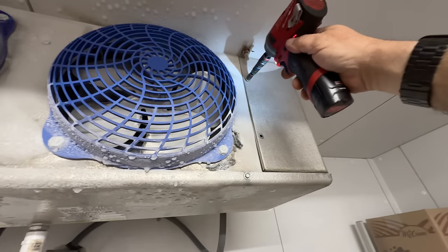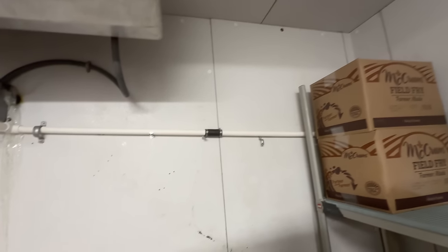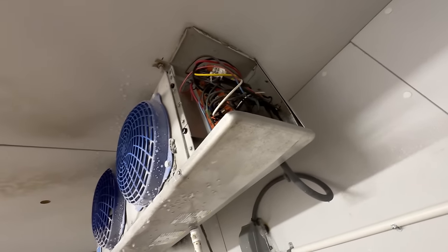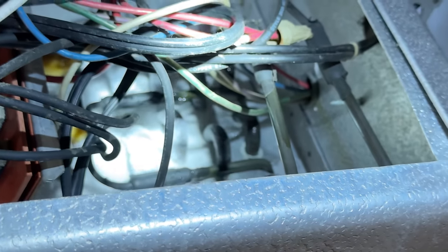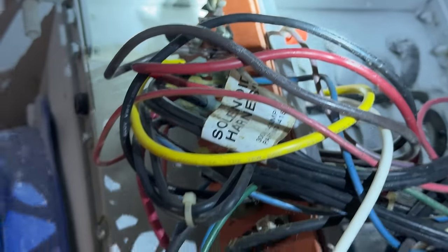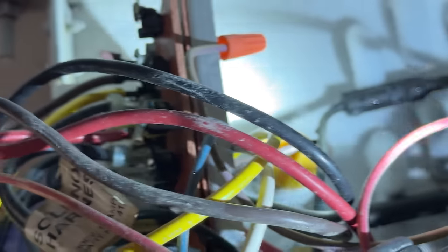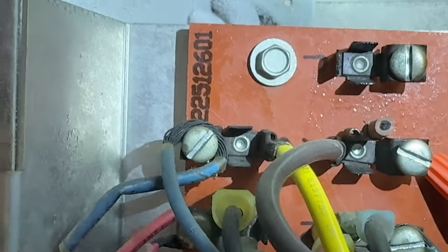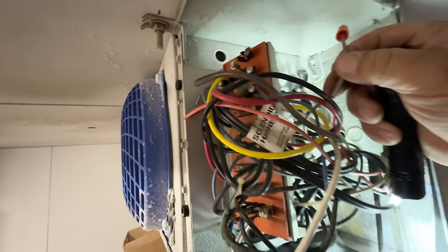Now we can go ahead and hop in here and see where our defrost termination is at. So far we are at nine minutes and 55 seconds. A 15-minute defrost ain't gonna do much for us — not a good idea. I've not seen too many regular walk-in coolers with a 15-minute defrost work. The defrost termination switch is right there. The X terminal — X terminal generally means termination — see that little wire there that somebody chopped off.